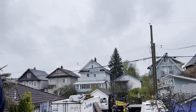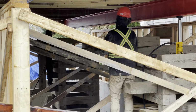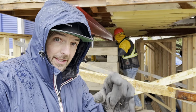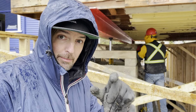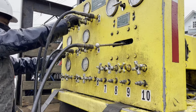Wes is just rolling in. There he is. We've got the boys all lined up for the prep of the D-lift. D-lift. That's the truck that has the compressors on it so that all 4 jacks operate at the same time. Basically they jack up the house a little bit, then to relieve the pressure of those beams on the cribs below, they take down the cribs about 13 inches, lower it down, move the jack down, repeat until we're sitting on our frame walls.